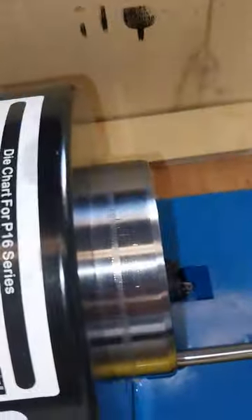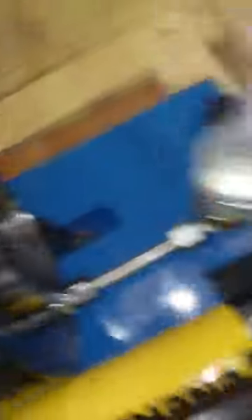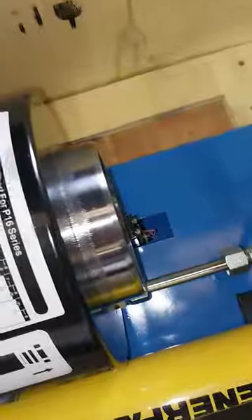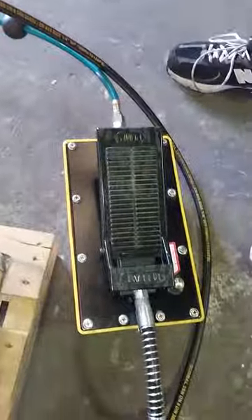Press down where it says 'pump' with your foot. That's actually moving in. When you let go it will hold, but when you press the release it will release oil back into the pump. Press release all the way — the pump and the crimp is now opening back up. You can let go and it'll stay released, so that's now ready for the next crimp.